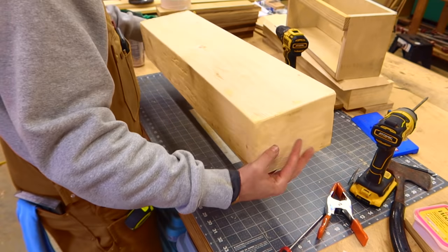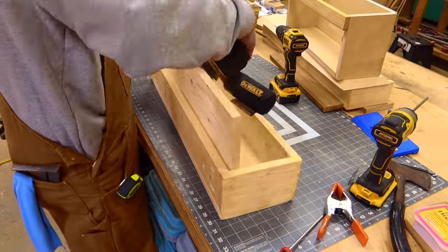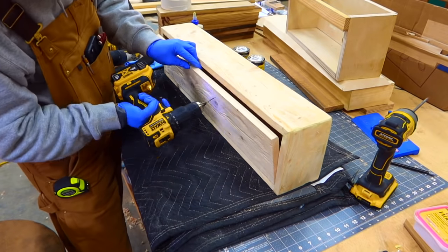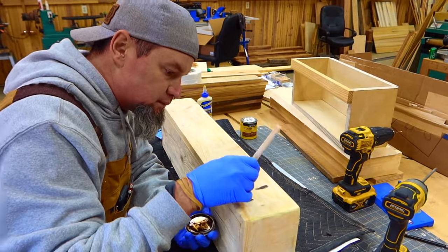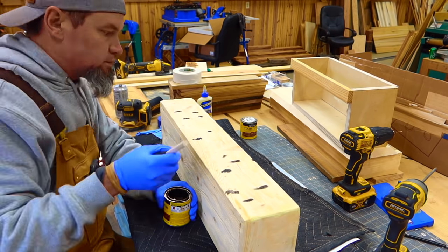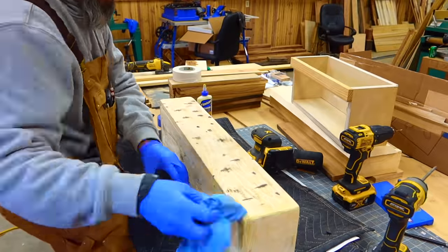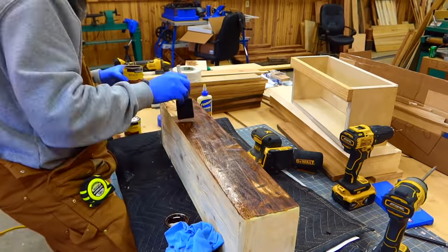It's all starting to come together. Let's go ahead and open it up — the tension from the hinges can make it a bit challenging sometimes. We're going to sand down this edge, just to keep it from clipping the edge of the box whenever it closes. Now what you're seeing me do here is just add synthetic wormholes — this is just a distressing technique. For my hatchet marks, I like to use a dark stain so they stand out. I'm using Minwax Express Color over those, and then for the top coat I'm using Minwax Early American — it's a little bit lighter, but it will make those hatchet marks pop.